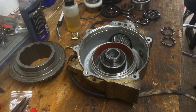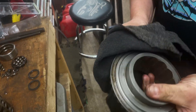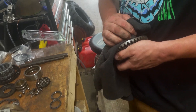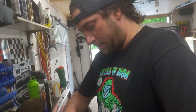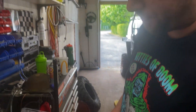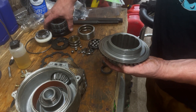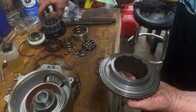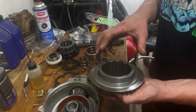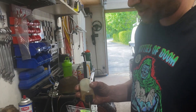All right, so I'm going to clean the main ring gear off. You also want to check these pins — they can break. If you have a machine that's not going into four-wheel drive, or it's going in intermittently, or it's going into four even when it's in two-wheel drive, that pin can be a culprit. Once that pin goes, it basically loses the ability to lock into the outer gear and keep the sprag basket centered into neutral. If you lose that, it can spin out and lock it into four. The old ones used to have plastic cages.